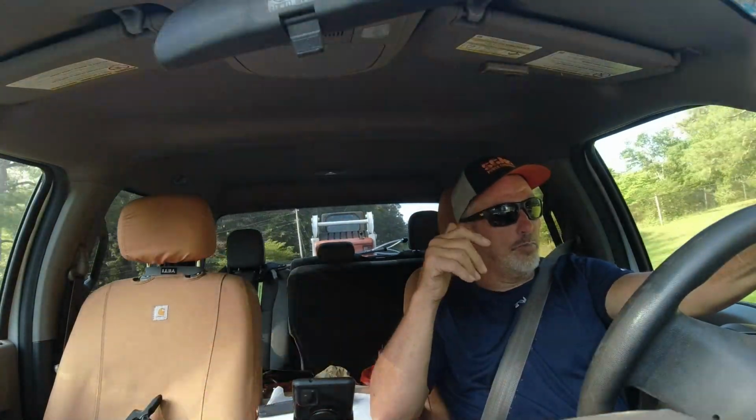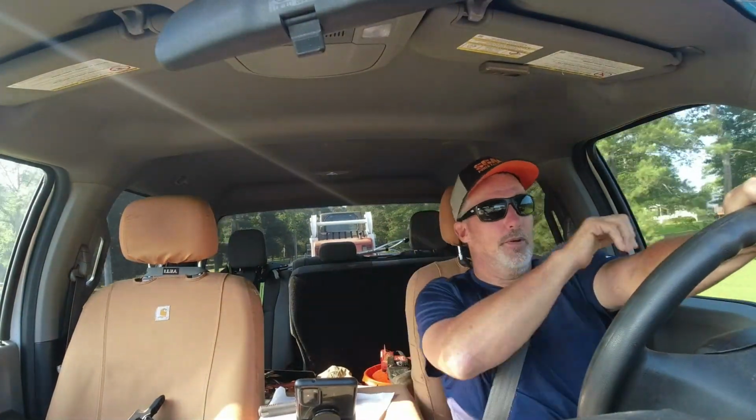When you're doing stuff like this, I'm not gonna use a stump bucket. If I do, I'm not going to put a lot of tension on it. I'm going to use a tooth bucket and the forks. The forks will be pretty good to loosen the ground up, and then I can put the grapple on there and use the grapple teeth, but you got to dig to get that stuff up. So I'm going to dig some of it out. There's a bunch of debris in that little area, and that's why it keeps growing up, because we can't do anything else with it.